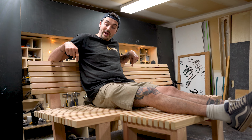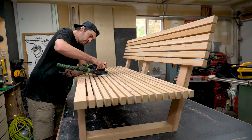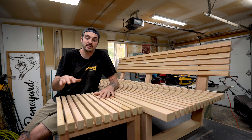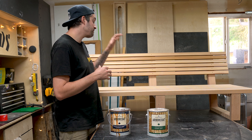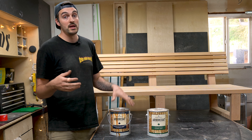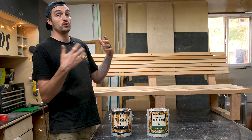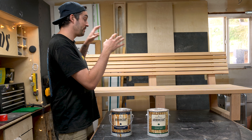And just like that we've got a bench, but we're not quite finished just yet. I've gone ahead and sanded the slats down with 150-grit sandpaper and also broke away the edges by hand to take away that sharp point. With the scraps I built a footrest using the exact same techniques. Next is to apply the finish so the bench can sit outside and remain nice throughout the seasons to come. For the finish I'm going to be using Benjamin Moore's Arbor Coat in natural - it's a stain that works really well on decks, fences, and outdoor furniture, and I've used it in previous videos. It works really well with cedar.